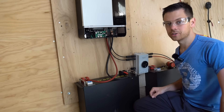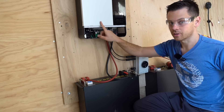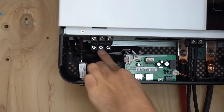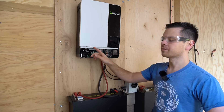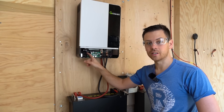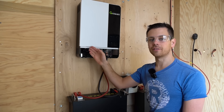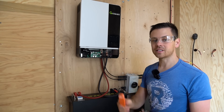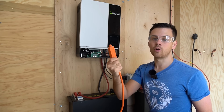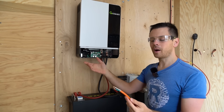The battery and solar panels are connected but don't turn anything on yet — we still need to attach our loads to the AC output of the inverter. That's done by connecting conductors to these three terminals: ground on one side, line or live in the middle, and neutral on the other side. This inverter can output 3000 watts, which is 25 amps at the output, so a good wire size for this terminal would be 10 gauge. You can use that to supply a small panel. If you don't plan to use the full output capacity, you can safely use an extension cord — for a 12 gauge extension cord that's 1800 watts maximum.